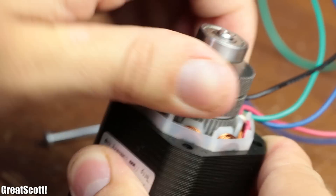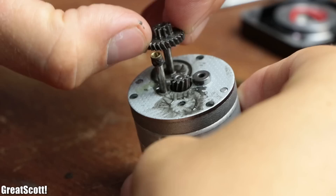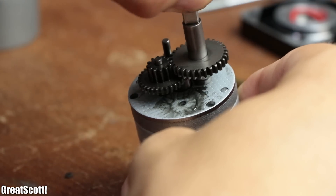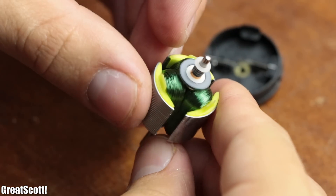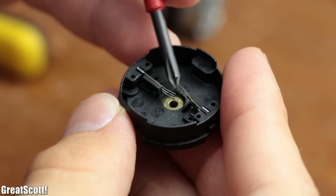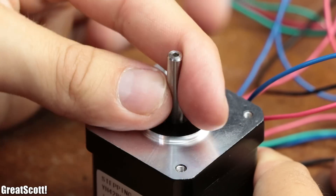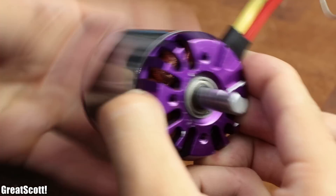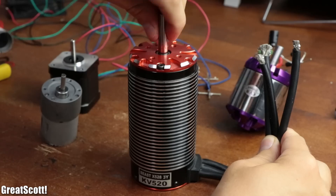The stepper motor worked well due to its motor construction, which is primarily intended for lower RPM tasks. Simplified: fast rotating motors need a gearbox when used as a generator. The conclusion is that DC motors are the worst option, because they mostly require high RPM, don't rotate well enough, and have lots of mechanical wear due to carbon brushes. If you want it simple, go with the stepper motor — it can be used without a gearbox, rotates well, and outputs enough power for fun little projects. If you want professional but complicated, go for the BLDC motor with a suitable gearbox, since they are mechanically the best and able to output lots of power.